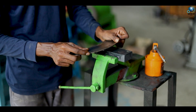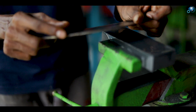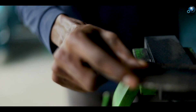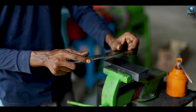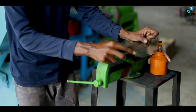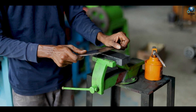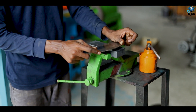But you should not pull backward — you have to always pull this forward side. Don't pull this backward side like this. Don't do it. Always we have to do like this. When you are sharpening, you have to make a right angle — make a right angle when you are applying onto the stone. Don't use too much angle. Just use this angle, and after that you can do it from here to here. You should do that from here to here, continuously.